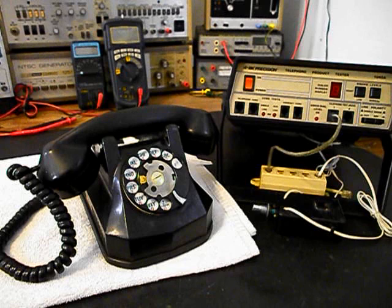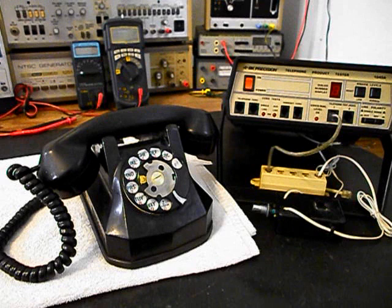We're also going to go through the network and all of the connections of the telephone. We want to make sure that they're tight and that they're working properly. The rotary dial is very sluggish, so we want to go through the rotary dial. We're going to clean, oil, and adjust the rotary dial. We want to make sure that the rotary dial is dialing out the numbers properly and that we have a good return. We also want to install a dial center card, something to the period of the telephone, so we'll take care of that issue.